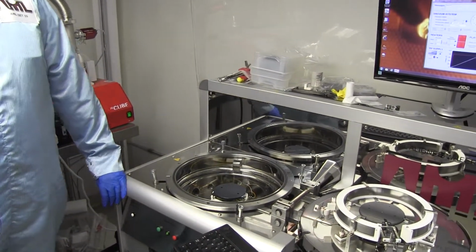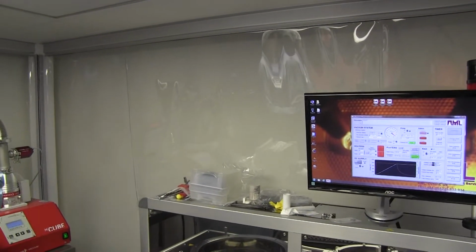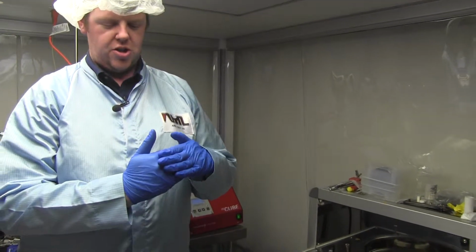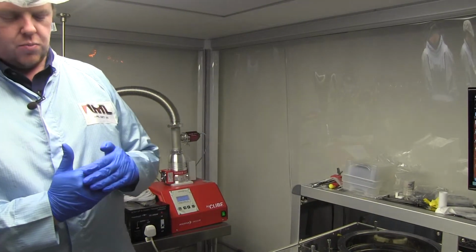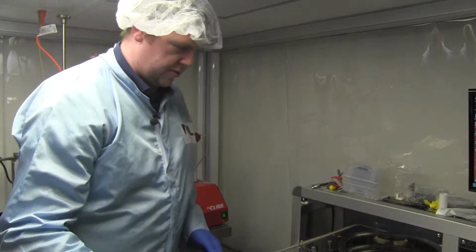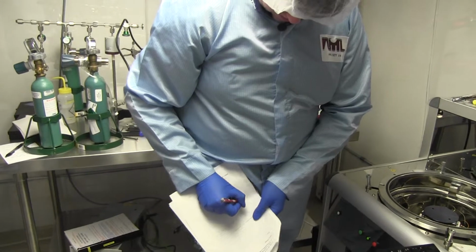Okay, so the way direct bonding works is you have a hydrated wafer surface. So there are essentially hydroxyl groups, kind of dangling bonds, on the wafer surface. You bring those into contact. Initially we have a kind of surface tension interaction, which is what we've got there. When you bake it out, a chemical reaction happens. It will generate a siloxane bond. So where's some paper? We have the wafer surfaces.